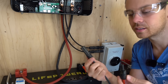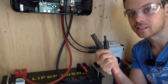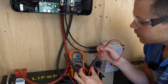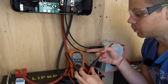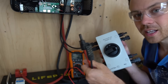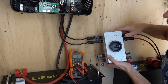Now we're going to connect some solar power to this system. These are connected to solar panels on the roof of this trailer that produce 80 volts, but before you connect them you want to test the voltage — if you give this unit too high a voltage it will destroy it. These panels are producing 94 volts open circuit, so they'll be about 80 volts when connected. Since 95 volts is less than the 150 volt max this unit can handle, we can safely connect them. Connect the solar panels to the input of the DC isolator switch, but do not turn it on yet — leave it in the off position.